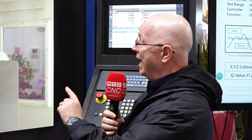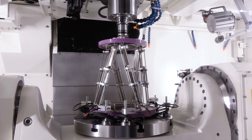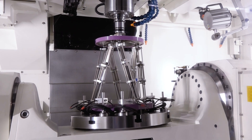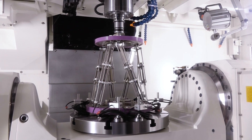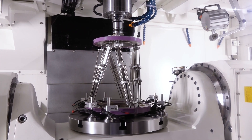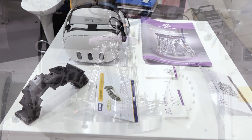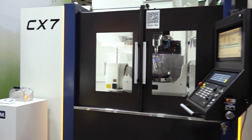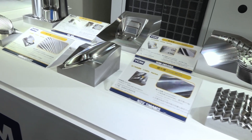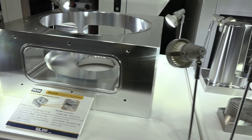This machine today has a 40 taper spindle, and all of our spindles today are BBT — a dual contact spindle. On a T13 series machine, we have a 6,000 RPM or a 10,000 RPM non-gearbox but high-torque spindle. I have a customer that basically wants to cut titanium on a day-to-day basis, but they need a little more Z and that 6,000 RPM spindle. That can be done on this machine very easily — this is the ticket for him. And as you know about titanium, it's not easy to cut. With this direct drive table and 6,000 RPM, no gearbox but still high torque, it gives us the ability to do his titanium parts.